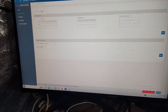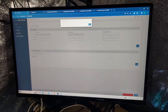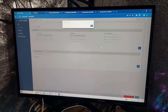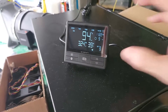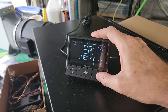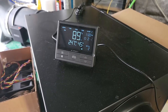One important step: put the miner to sleep while you adjust the fan settings, because the fan is likely to turn off during adjustment and won't spin back up fast enough, causing your ASIC temperature to spike quickly. You don't want to take any unnecessary risks. Once it's asleep you can see that temperature dropping — and enjoy that silence while it lasts, because it's not going to be for long.